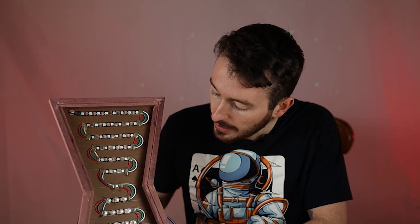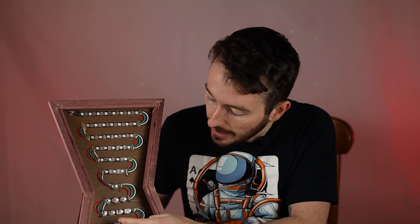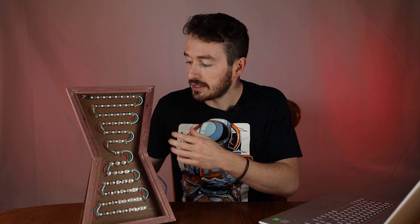Aside from memory limitations, it came out really well. We have about six frames per cycle. In each cycle, sand drops from the top, trickles down, and accumulates at the bottom. Each cycle we take the count of LEDs, subtract from the top, add to the bottom, and draw the LEDs relative to the snake pattern. I'll leave the code link in the description with more comments, and I'll probably write an Instructables post with even more details.